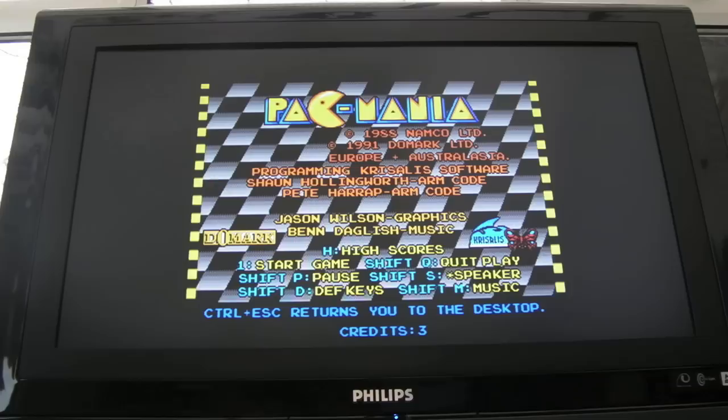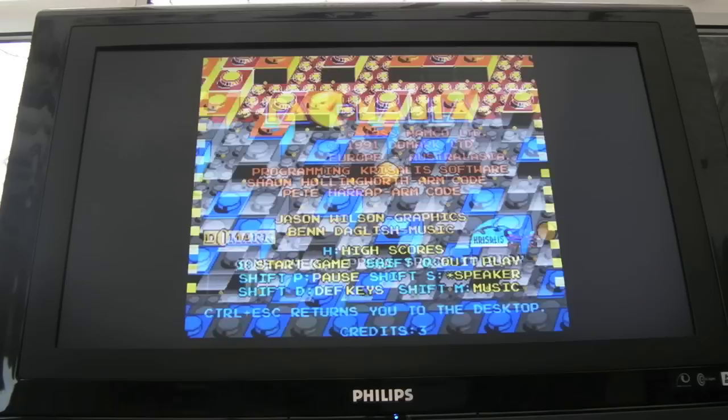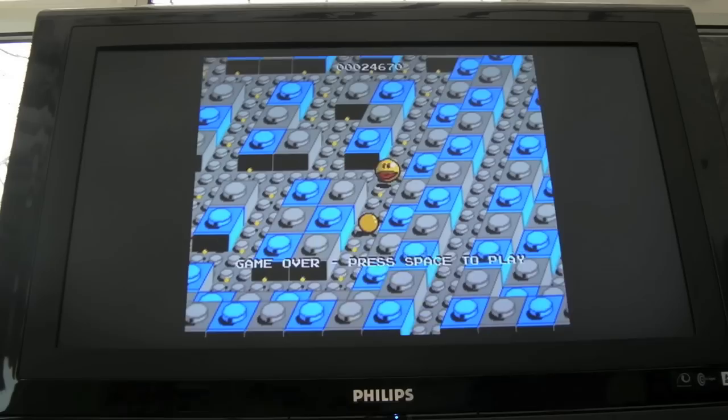I ended up ultimately stripping down the 3010 disc drive again, cleaning the heads, reassembling it, formatting the discs. One disc I found there was some bad tracks on it, the other one's fine. Copied the game back over, and it's worked. But I kid you not, I spent 4 or 5 hours on this yesterday.